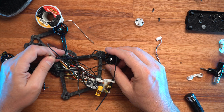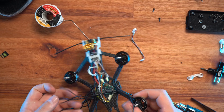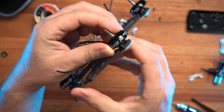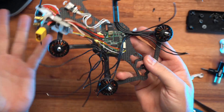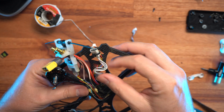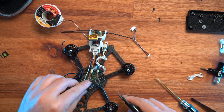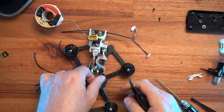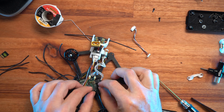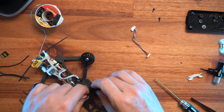Motor one is done. Now we're putting in four new motors. It's definitely a good idea to fit all the cables in through the wire protectors. We've got all four new 2300 KV Xing motors mounted. Next we're going to cut those cables to length — don't cut them too short and don't cut them too long, about a centimeter away from the actual pads.